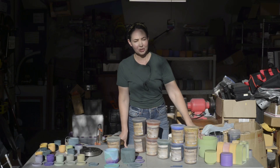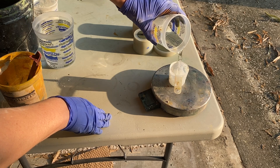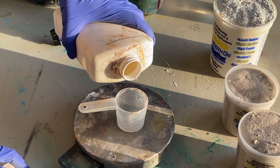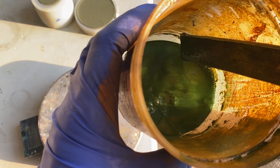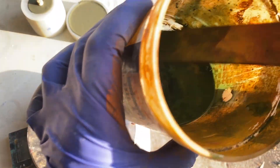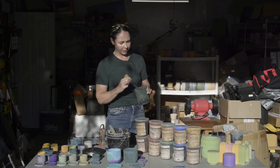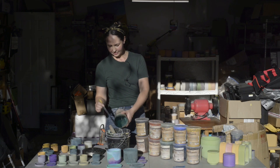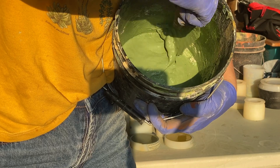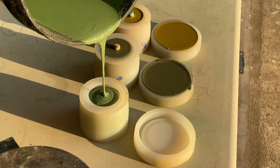To ensure even pigment distribution, I always like to dissolve my pigment in my mixed water first. I have measured out one part water and I'm going to add that to my pigment powder. This is also the step when I add the water reducer. When mixing, you do want to make sure that all your pigment has been dissolved, especially concentrating on any that might have settled at the bottom. Now that our pigment is fully dissolved, we are ready to add it to our concrete mix. One of the benefits of working with a water reducer is that it improves the workability of concrete, especially for these tiny little projects where it makes it much easier to pour into the molds.